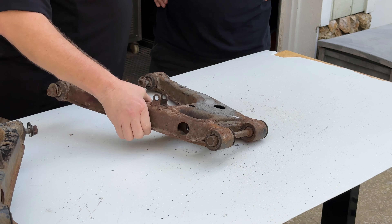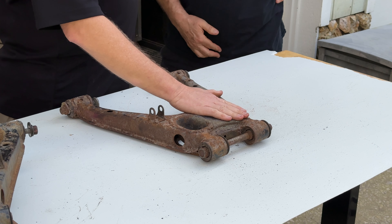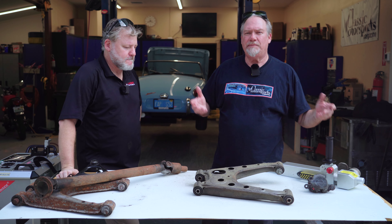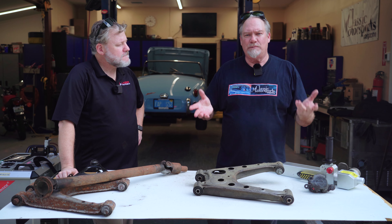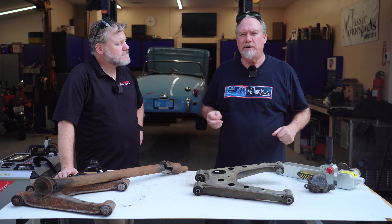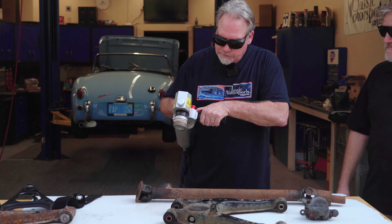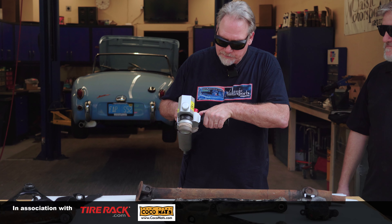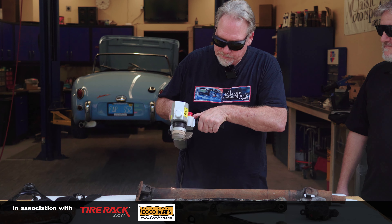As you can see, it did cover a wider area, but you're going to have spacing where it didn't hit — it's doing a clean sweep. Somewhere halfway in between would probably be optimal for this kind of piece. I do a lot of media blasting, both in a cabinet and outside. Obviously when you're outside, it's a filthy, dirty, miserable job — you've got to wear a full suit, it gets in your ears and your eyes no matter what you do. This is pretty darn easy. I mean, sitting here I've got my street clothes on.